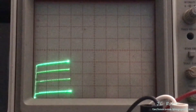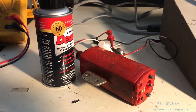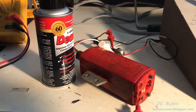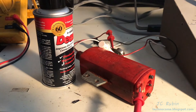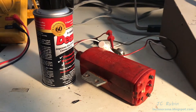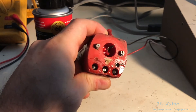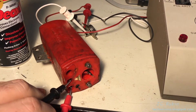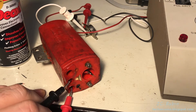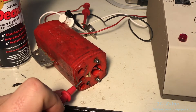The takeaway is that there is nothing wrong with this transistor. After some badly needed Deoxit, I was able to measure the black connector to the plug wire at 4.4K and the red to the plug wire at 1.3 Meg. These terminals were in bad condition but are looking better now. Black to yellow climbs on the resistance test, which tells me there is some sort of capacitor in between there, and I'm getting nothing from yellow to red or yellow to the front coil — I'll assume that's by design.